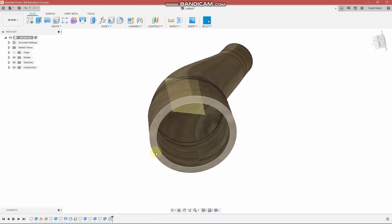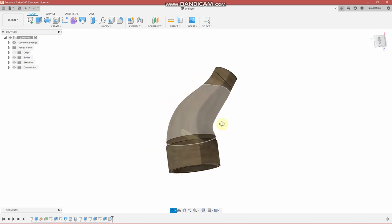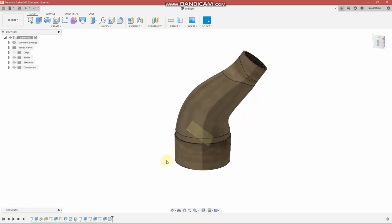So the other thing I want to take a look at is how it's going to connect to the base plate, build plate rather, on the 3D printer. And a circle generally is going to be a very, very strong shape that's not going to warp while you're printing. If you have square edges, however, printing with ABS, you may have problems with the edges lifting up and peeling away from the build plate. So I like to, whenever I can, use something with circular or radius corners, and that helps to prevent the raising up of those edges.